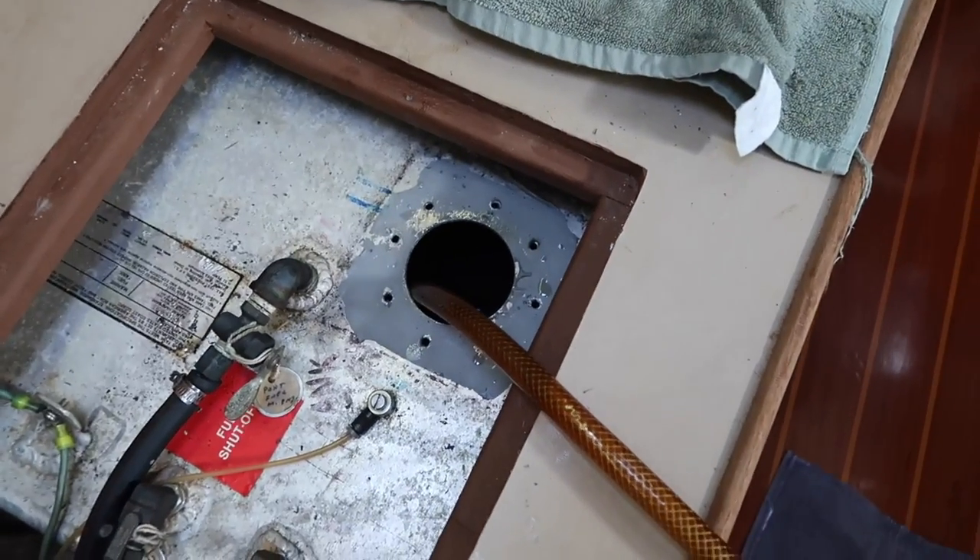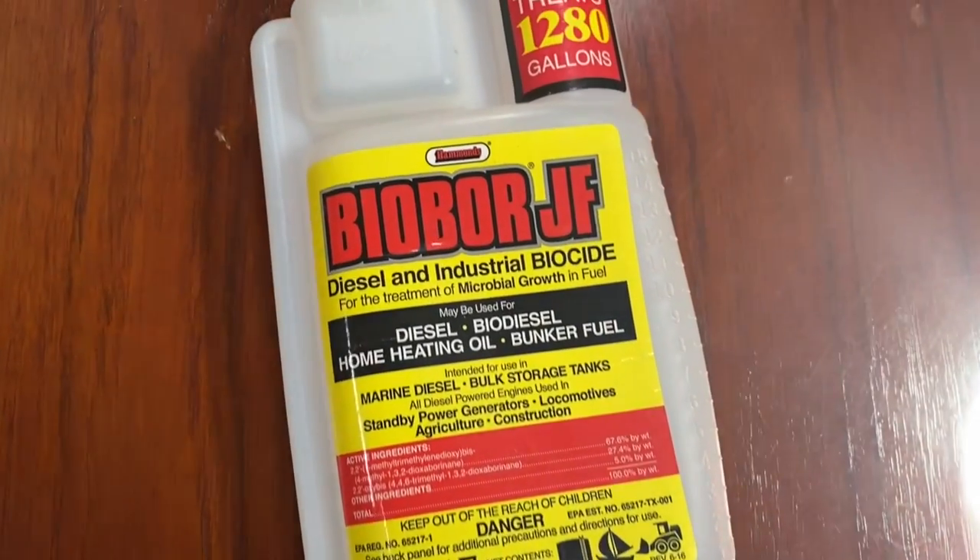These filters are a bit bigger than your average sailboat Racor so they can handle a lot more flow and take a lot of gunk before getting clogged. There's a piece of bent copper that came with the fuel polisher — it's all kinked — so I just used some velcro to give me a little handle to move the pickup end around. There's a baffle I cannot reach where the pickups are, a second baffle with an access port, a third and fourth baffle. I'll pick up from here and transfer through the polisher into the other tank. I'm also going to fill these tanks to the top and keep them topped off to prevent condensation and water buildup, which causes these diesel bugs to grow. I'll add a little biocide with every fill-up going forward — I don't want to deal with this again.